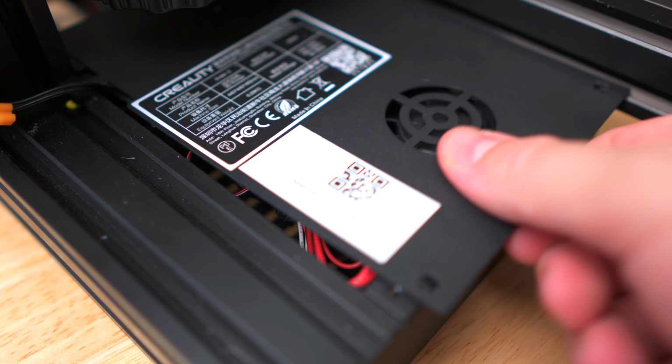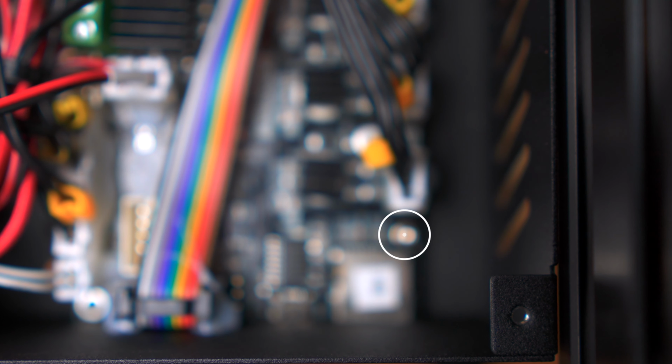Now, these M2 bolts are actually so tiny that it's not feasible at all to replicate them with an FDM 3D printer. But luckily for us, all of the M2 bolts are actually passing through the electronics such as the PSU and the motherboard on our 3D printer. And those are components that I can't change anyway, therefore the rules allow me to keep those bolts. But for the M3, M4, and M5 bolts, I'm going to be doubling the diameter of the thread, and hopefully that's going to be a success.